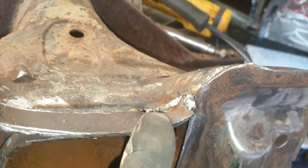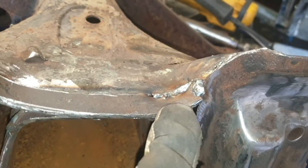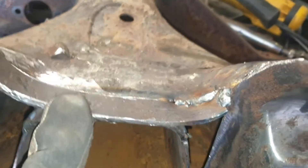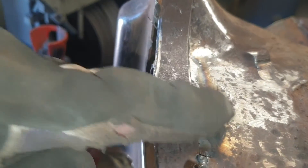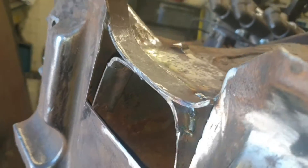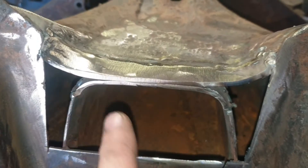And this is the second part. I've tacked it in here because this is 3mm thick — it's quite hard to bend in just your hands. I've tacked it in and I'm just hammering it along as I go, getting it level, and then I'll just hammer and weld, hammer and weld, and follow it along so it holds itself in place. I'll show you that finished in a minute. It's all getting welded now. Right, that part's welded in — that's one part, that's two parts.